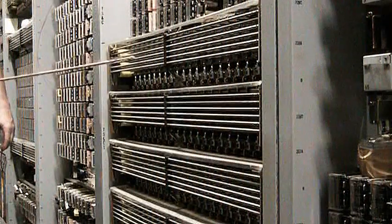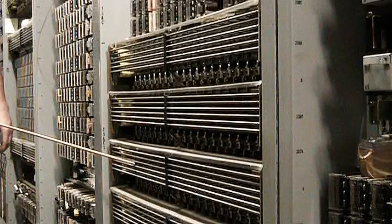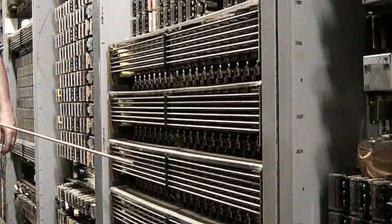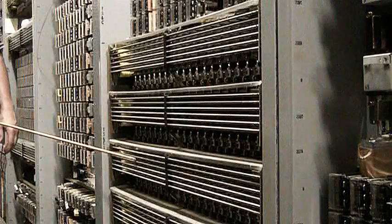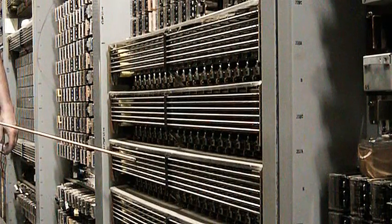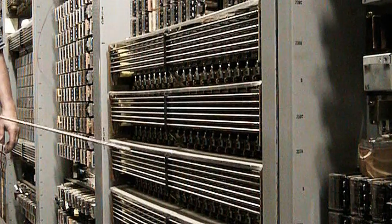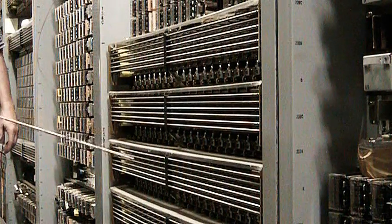Here are the junctor switches within the number 3 crossbar. Every single call, internal or external, either incoming or outgoing, is completed through these. There are 9 of them in this bay, but we're only showing 3 at this point.